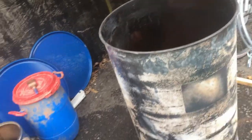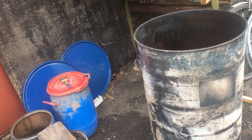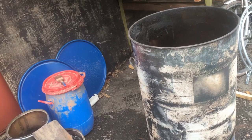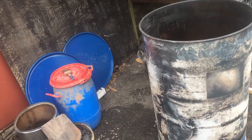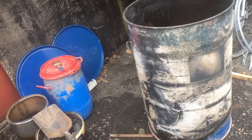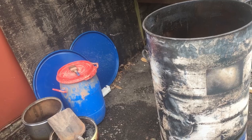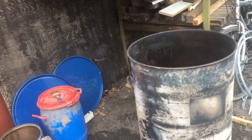A thicker slip, I think, would be good to have ready for when you've started the fire and you see it starting to steam. Paste on a thick slip at that point, and you might be able to get the greater effect without having to wait a day to dry. So all about the drying time.